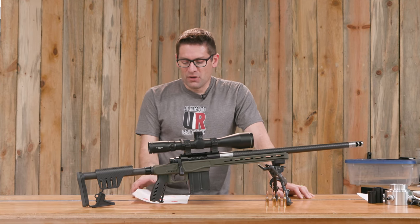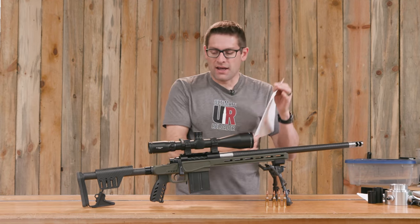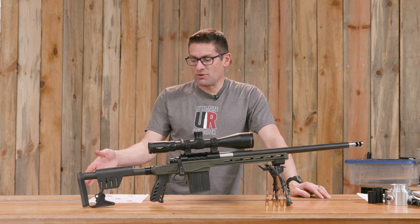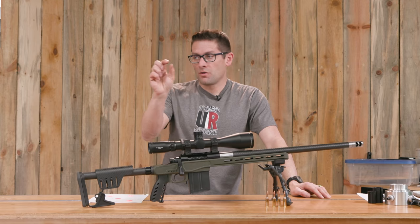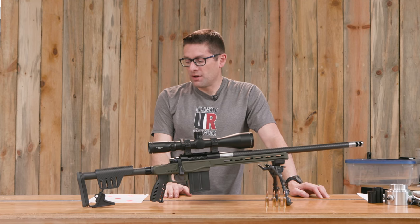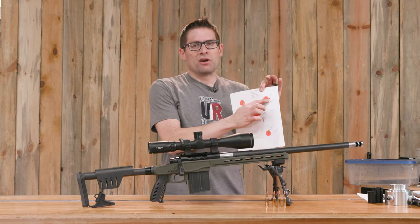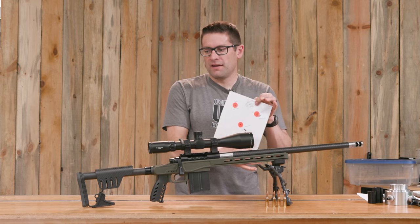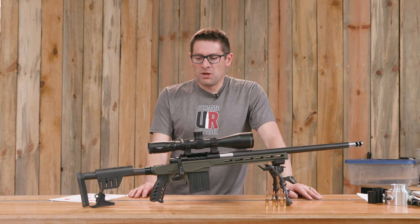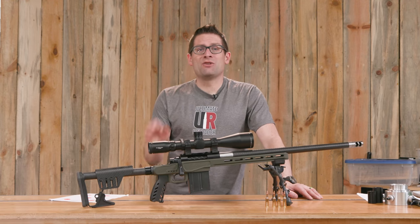I was very happy to see that. I jumped to five-shot groups. The first went into a .523-inch group — shots 11 through 15 — that's probably exactly half MOA when you divide by 1.047. Shots 16 through 20 went into a .574-inch group. This is my first experience with Benchmark's new patented carbon barrel technology, and I'll say for the number of shots fired this is probably the best result I've seen in terms of not having any stringing. Nice round groups — no tendency for vertical or horizontal stringing. With some load development I think we're going to get results probably in the third-MOA range with five-shot groups, which is really spectacular for an ultralight hunting rifle. The trigger worked well overall, though I'm going to make some adjustments. For an ultralight hunting rifle with no load development, I could not be happier.